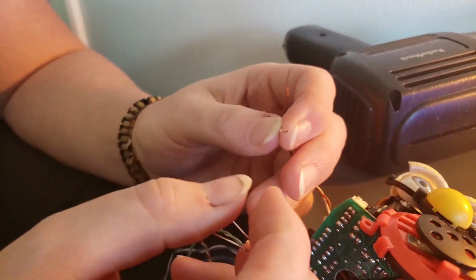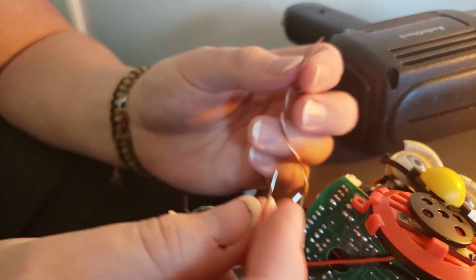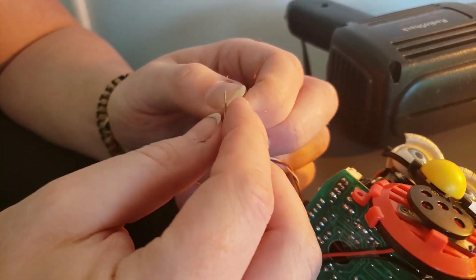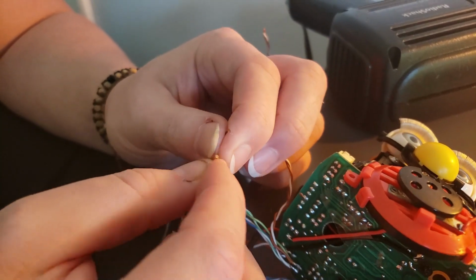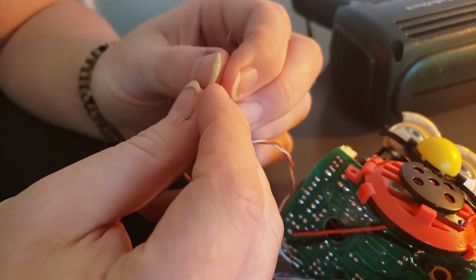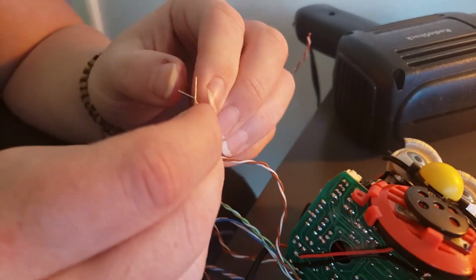The LEDs inside the eyes. Now you can do this with a Furby with a breakout box, without a breakout box. We're running a couple LEDs on this. We're actually going to be running LEDs inside the breakout box as well. But very simply, using these 4 points that we solder onto, we're going to feed this LED out.